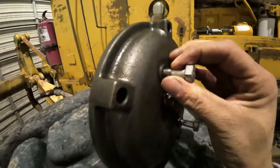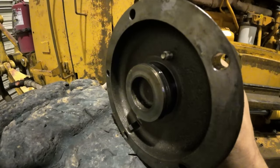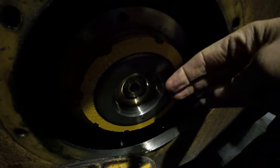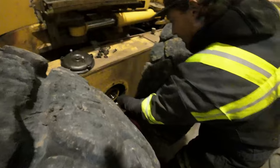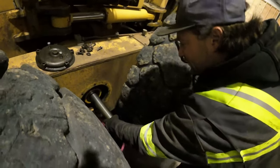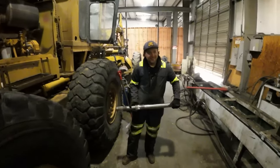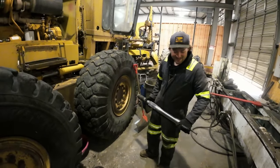Using pusher bolts threaded into the cap — the same bolts that hold the cap on — you tighten them up and they push all the way through, popping the cap right off. We're two for two. What freed it up and made it loose was shoving it in here with the D8 — it was cold outside and he just wanted it in the shop.